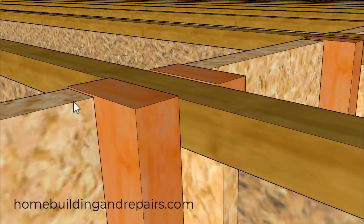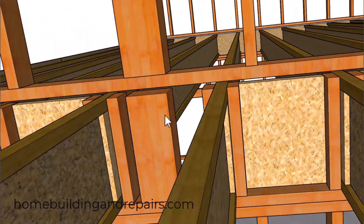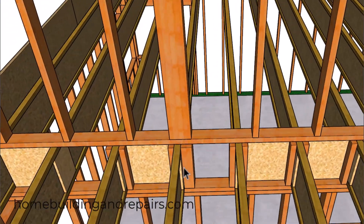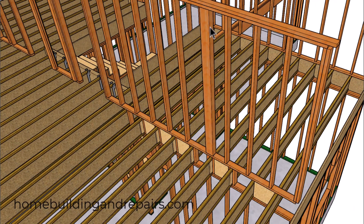You can see the sixteenth-of-an-inch taller squash block here, and there's a good chance it's going to be taller than the other blocking materials mentioned. The manufacturer also suggested using solid blocking underneath any type of structural post that is going to be transferring loads through the walls. Even though I'm showing a section where the post is the same size, the manufacturer suggests you can use multiple squash blocks as long as they fill the area under the post. If we move the post over, then we're going to need to use blocks on each side. Don't forget that if you have a support post transferring a load through a lower wall, there's a good chance you're going to need a post in the lower wall along with a footing to support it in the building foundation.